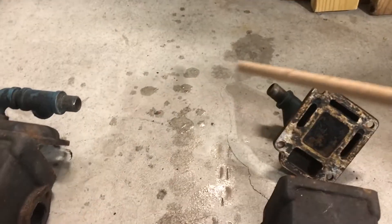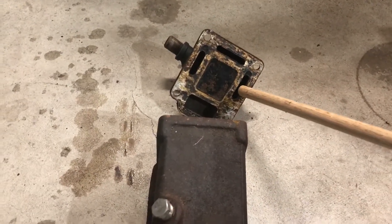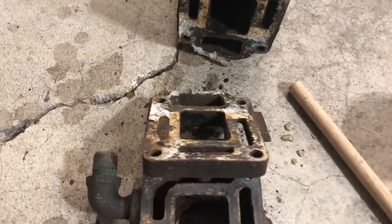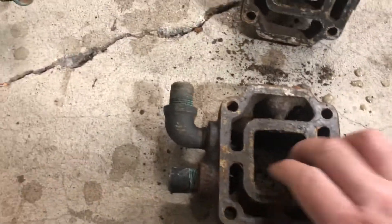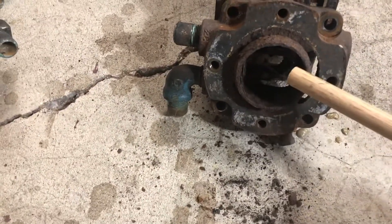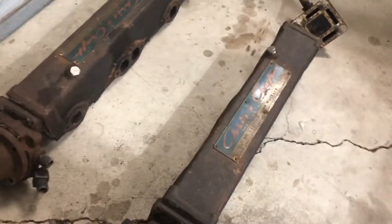It comes out of the heads into this nozzle, exits this port into the exhaust manifold, travels down, comes out through here, enters this distribution plate in this slot, and then mixes with the exhaust gases and exits the boat. That's how a three-pass exhaust manifold works.